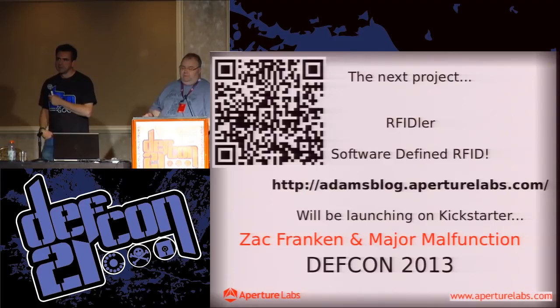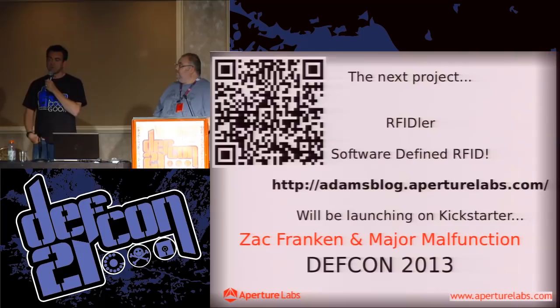So can you generate the CRC after the fact to make sure it's still good? Yes, in fact, the disassembler, my disassembler, will show you what was stored. The last two bytes in the ROM are the checksum, and it will also recalculate and tell you what those came out as so you can see if they match.